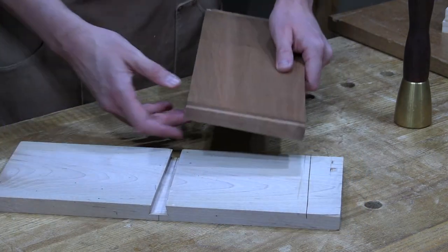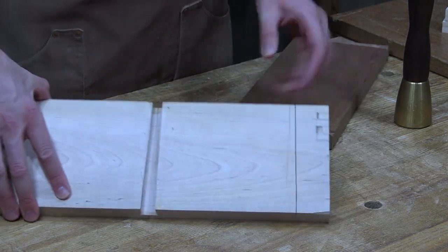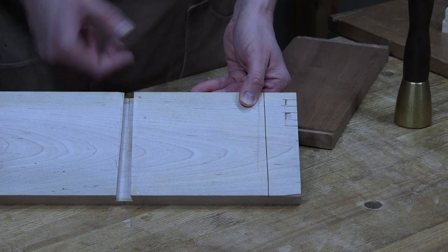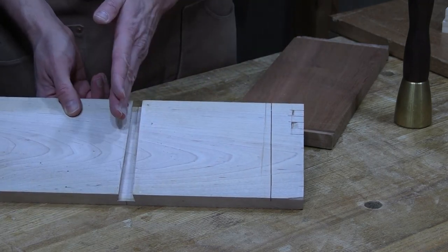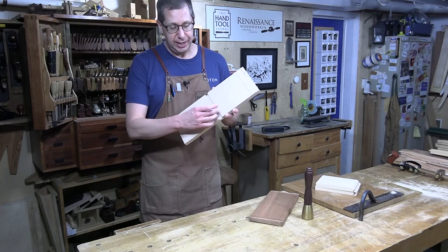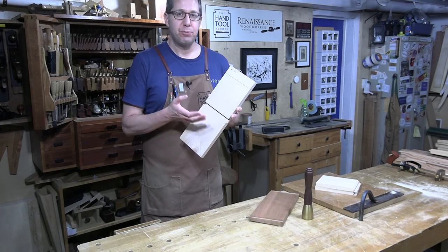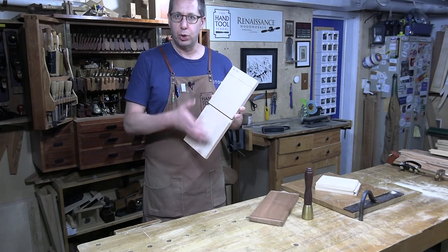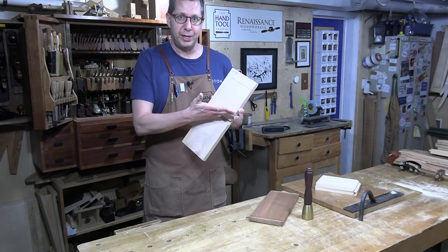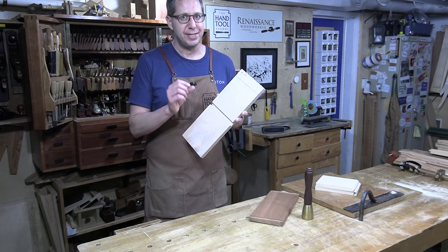You might look at this and go, man, that's super complicated, but honestly there's not that much to it. This is tapered on both sides — you can see how the whole socket tapers on both sides. A lot of people will tell you to leave one side square and only taper the top side, and I would absolutely recommend that. Taper only one side and leave the bottom side of that shelf or drawer blade flat and square across the piece. This really allows you to get the spacing of your drawers or elements exact. Once you start tapering both sides, you risk slightly skewing the shelf or messing up the spacing.